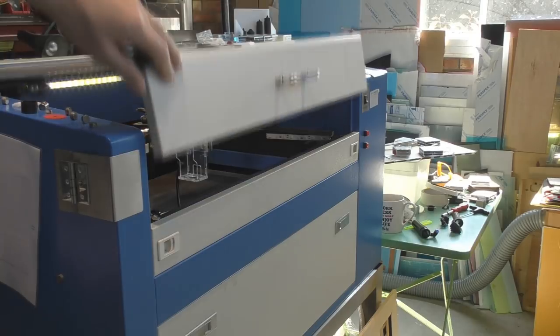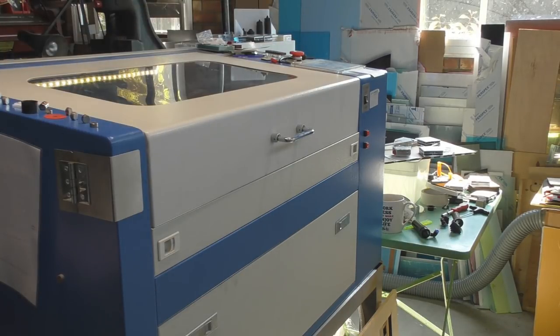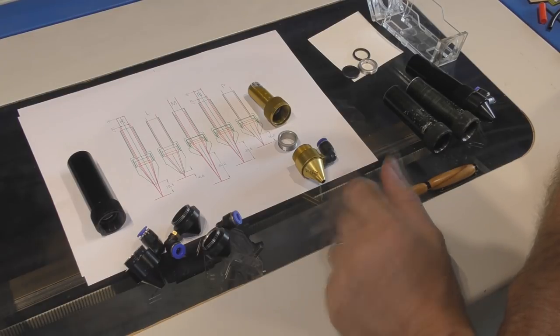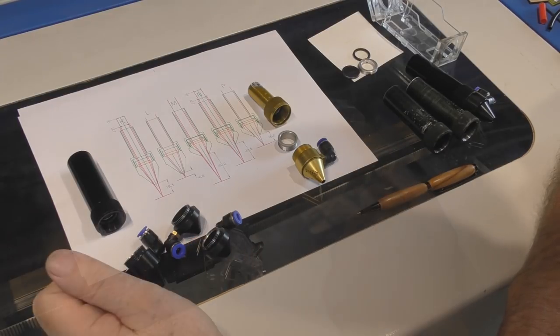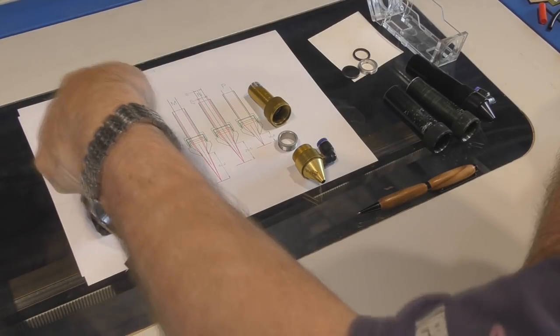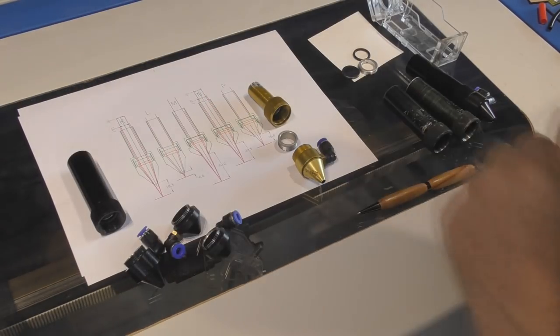Yes, I've had to occasionally polish this one in particular, but it's only been like a 10-second polish. You can clean these with isopropyl alcohol because they tarnish — they're not protected by anything — but the amount of tarnishing takes place very slowly over quite a long period. I've still got my molybdenum mirrors in the background ready to replace these if ever I need to. We've got our head re-transplant complete. What I'm going to do is close the lid on that temporarily and talk about the great new world that has just opened to you with a China blue machine.